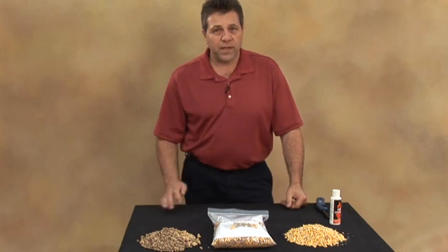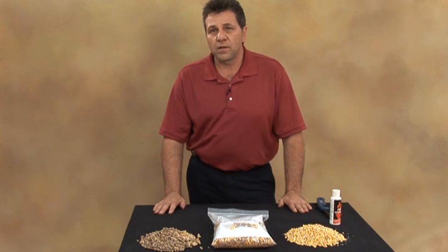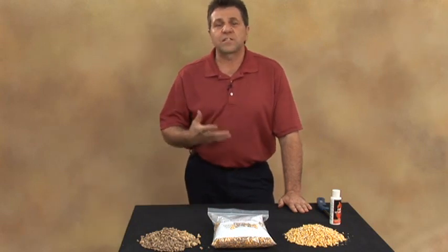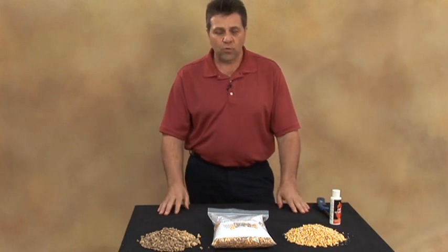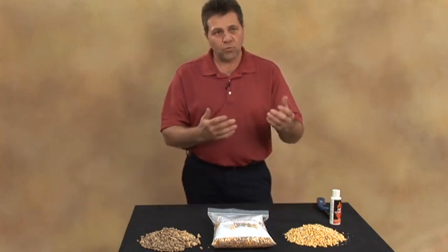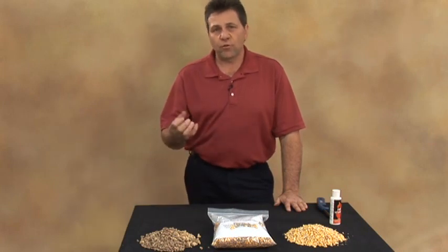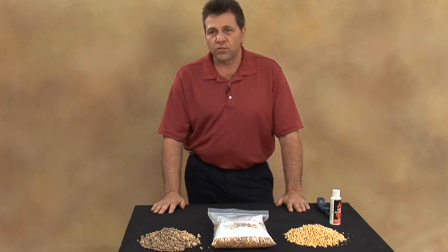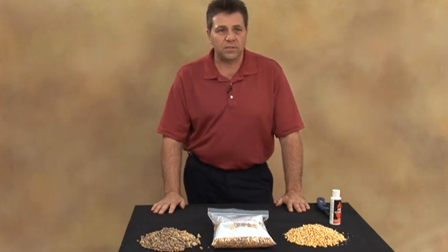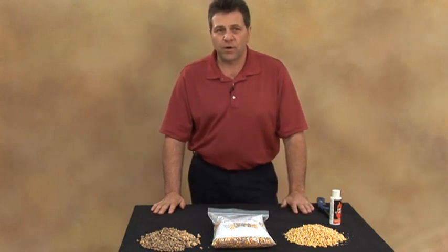A few other things to watch for when you're talking about fuel is humidity. If your home is running exceptionally high humidity, like in the basement, your fuel may have a tendency to stick together as it flows down through the feed system. So you want to make sure to control the humidity in your home, so that it's low enough that it will not affect the fuel feeding system, which would then affect the quality of the burn inside your fire pot.